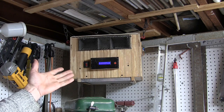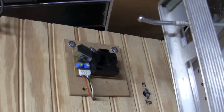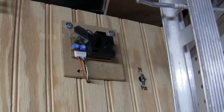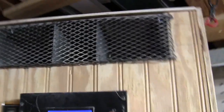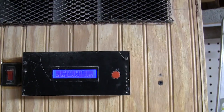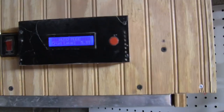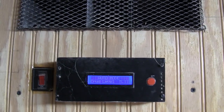And you'll notice it ain't running right now. And the reason for that, if you haven't seen the video, is because of this little parasite here. This is a particle counter, and yep, no surprise, it counts particles that are in the air, and when that number gets too high, or that ratio gets too high, what happens is it will kick on the fan. I've got a couple of filters, one on the bottom, some more on the top. That'll start to clean the air, and that number will come down, and eventually the fan will kick off. So it's completely automated. I don't have to think about it. All I have to do is clean the filters every once in a while, and the thing just runs and runs and runs. I mean, it's been on for years and hasn't choked on me yet.